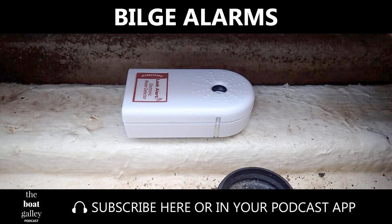Dave was standing right over the bilge access panel and looked in. He was rather shocked to find a couple of inches of water in the bilge, which is normally totally dry. Barefoot GAL is a catamaran. There's no stuffing box, and her bilges are very shallow. We typically check the bilge every few days, and there's just absolutely nothing ever in it. The first thing to check in a situation like this is whether the water is fresh or salt, so you know where to start looking.